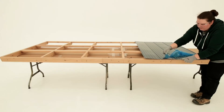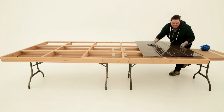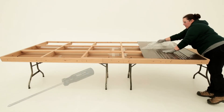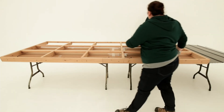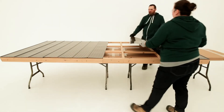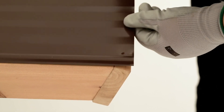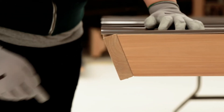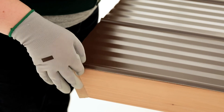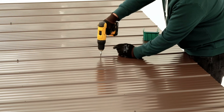Step 8: Attach Roof Panels. Gloves are essential for this part of the assembly because the roofing material can have sharp edges. To prevent scuffing, remove the clear and blue plastic from both sides of the aluminum panels right before assembly. If you are using a power tool, be careful not to over-tighten the screws. We recommend hand tightening the screws until they are snug. Step 8 should be done on a flat and solid raised surface. Start by placing a side panel on one end of the frame assembly. Next, place the two main panels so the ribs overlap, followed by the second side panel. In the correct position, the holes next to the ribs will be along the top of the frame assembly and the panels will be flushed to the top of the frame assembly with a slight overhang along the bottom. The two side panels will also be flushed to the sides of the frame assembly. It is okay if they aren't quite flush; however, they cannot overhang. When all panels are aligned, secure with nine roofing screws where shown here and on page 26 of the instruction manual.